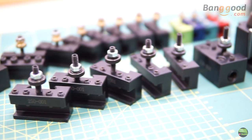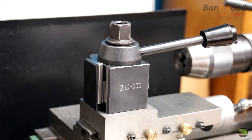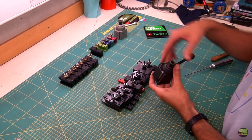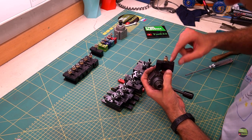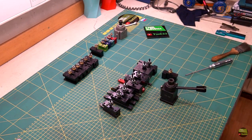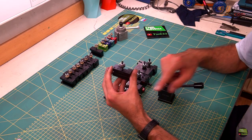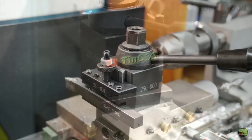That's pretty much it for today. The only problem I found is that the worm gear wasn't fully finished. Otherwise I'm amazed how nicely they finished the toolpost and each holder — every edge and everything is so smooth and solid. One thing is clear: there are never enough tool holders, so I need at least another five basic holders. They're so cheap that making them isn't worth it, but I already have a 60-degree mill and I will make some holders. I'll probably choose hard aluminium since it's strong enough for this small lathe and there's no problem with magnetism. If you need a quick change toolpost like this, check the link below. Also welcome to check my video about lathe tools. Thanks for watching — like, share, and subscribe if you like, and see you next time.